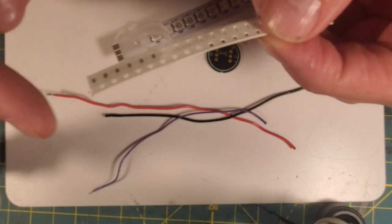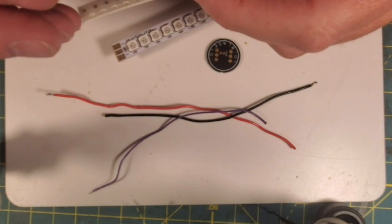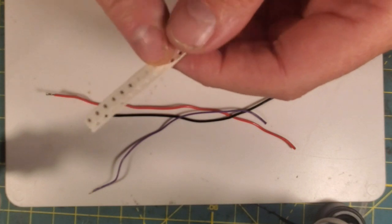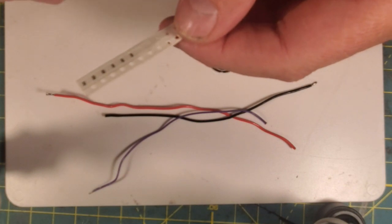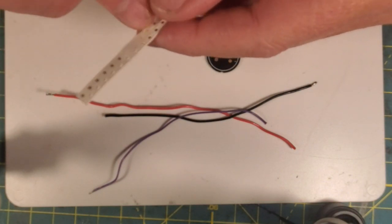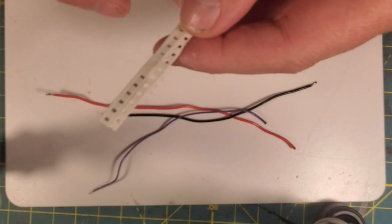And this blade is designed for a Proffie, which already has the data resistor installed on it. But I'm going to go ahead and add the resistor onto the blade, because that way the blade can be used in any saber, even not a Proffie saber. And if any of you are wondering, Frederick's tested the impedance here, and he's run double, triple resistors, I think up to 1500 ohms, and the data signal still gets through just fine to the Neopixels. So don't be afraid if you have a resistor on the Proffie and a resistor on your Neopixel blade, because the data is still going to get through.